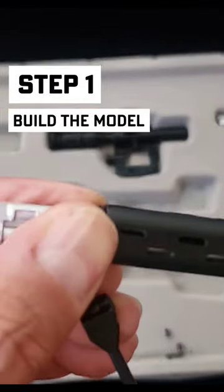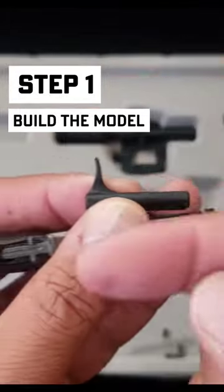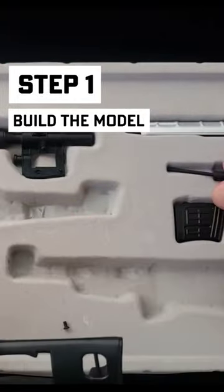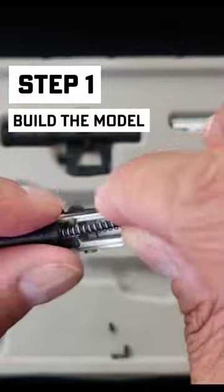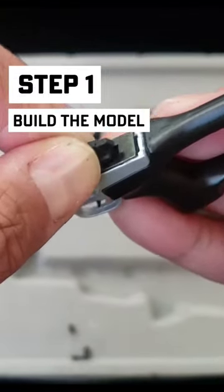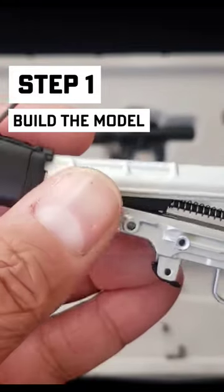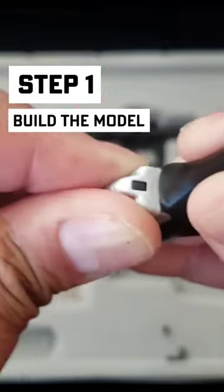Take this piece and slide it back — the charging handle. The handle piece is the front; put it under this little track just like that. Hole in the back, take your spring, push it forward and get it on the track in the back. There we go — now you can charge it. This front piece goes underneath, jiggle it a little bit.